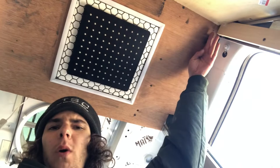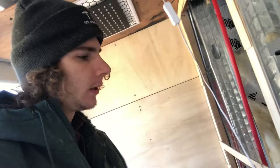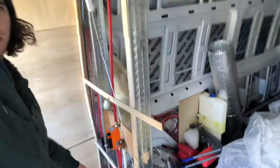There it is installed, looking pretty good. Now I'm going to do my walls — I had to put my ceiling in first so my walls will butt up to it, and the walls will kind of act as another holding point. And I know a lot of people scribe their walls with like cardboard or they just cut a big sheet of plywood and slowly chip away at it, but I thought I'd show you a different technique. I cut some really thin strips out of plywood and just tacked them together to fit this shape, using a little pin nailer. And if you don't have a pin nailer, you can use some hot glue or even tape. Now I'm going to take this out, place it on my plywood, and cut it out.